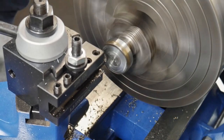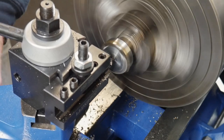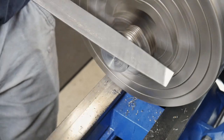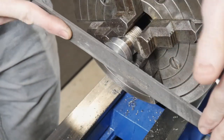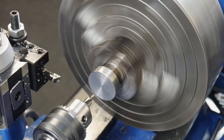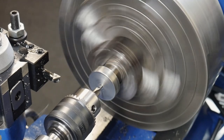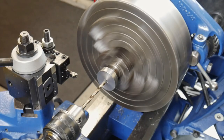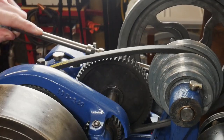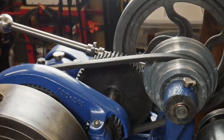This face I'm facing here in the lathe will be met up with the nylon head of our mallet, so it needs to be nice and square. Once we have the face square, we'll take a file to knock off the edge and also knock off the little nub in the center since my tooling wasn't perfectly set at the right height. We're then going to drill a hole in the center of this cap — starting with a centering bit, then a quarter-inch bit, then drilling up to the appropriate size to tap this cap with three-eighths by sixteen.